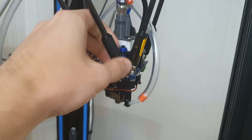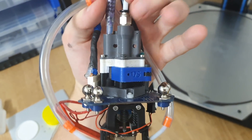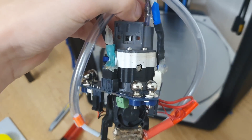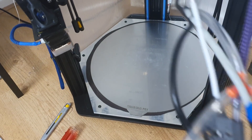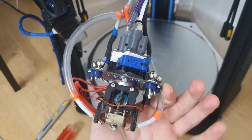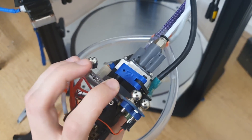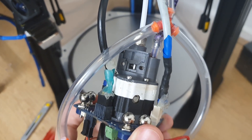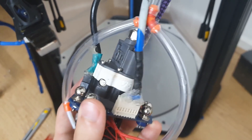Next up on the printhead we have the extruder mechanism. This is a flex drive extruder — it's quite old, I think I've been using it for almost two years now. It works well, but retractions and especially jerk values need to be on the low side. I can't actually print that fast with it, especially intricate models with a lot of retractions and sharp corners. I'm actually working on a replacement. The top gray part is designed by myself, and it was supposed to accept a Duet laser filament sensor, but I got really inconsistent results, so it's not on there anymore.